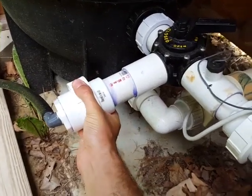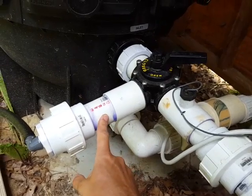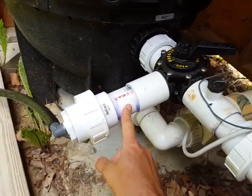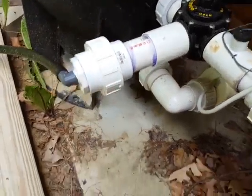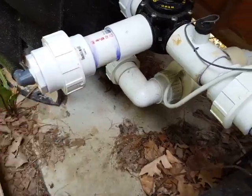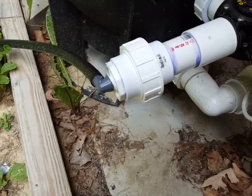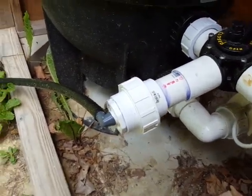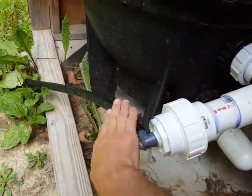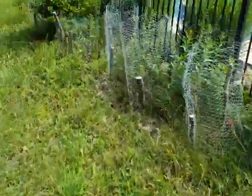This right here is a union, which I thought would be a good idea because I didn't want to run two-inch PVC all the way over to where my solar panels sit in the sun. So I come over to this union — I could change this out to be anything — and then I convert it down to, I think, a one-inch barb right here that I'm using to go out to the heat exchanger. Now I'll go over and show you: this is just irrigation tube that you get at Home Depot. 100 feet of this stuff is $20 to $30.